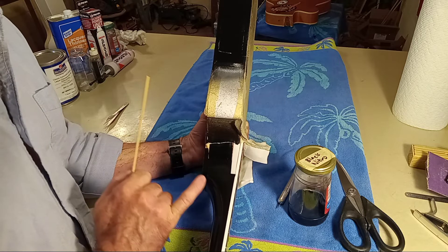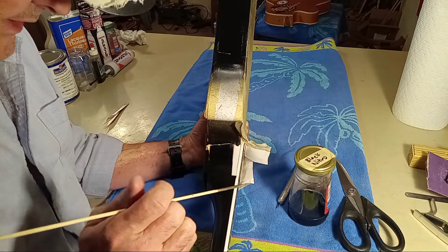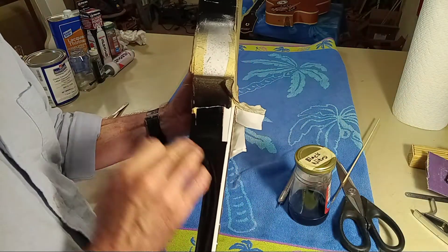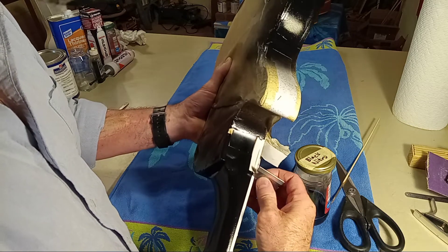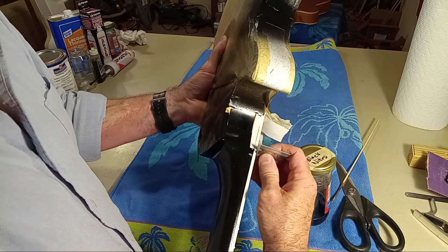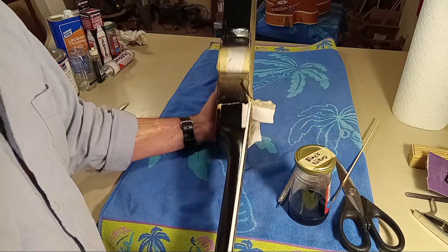I don't need wood fillers — I can literally use black lacquer to level. If I have a low spot, I'll drop some black lacquer in. When you do stuff like that, let it dry for a minimum of 12 to 24 hours — prepare to be patient. Then you can come in and even if you got black up on the white binding, you can clean up that little overhang.